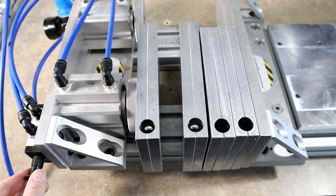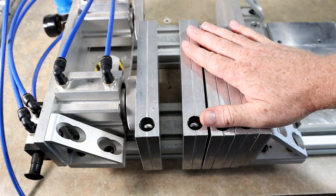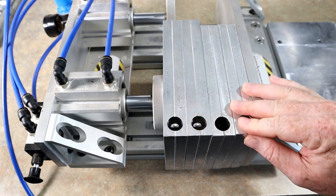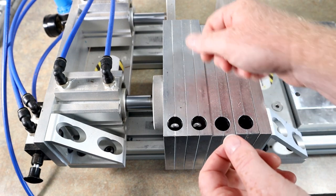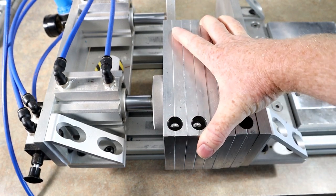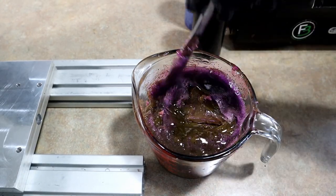If you've never seen the pneumatic air vise, what an awesome system for bait makers. This is a double rail, so I can fit really large plate molds, but the stick worm molds fit on a single rail. We now have about 80 PSI locking these molds together, so we're not going to flash. It makes it great to run a large volume of injection without worrying about individual clamps or flashing.